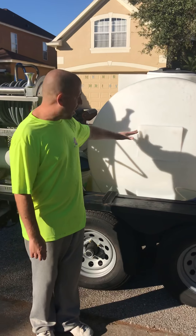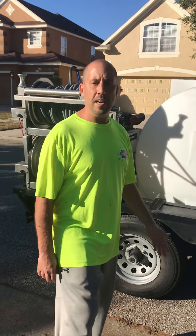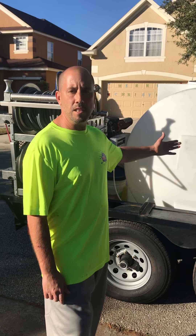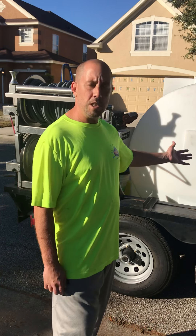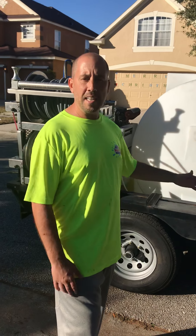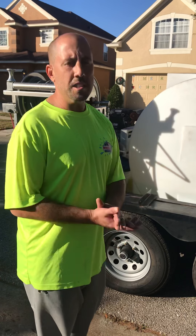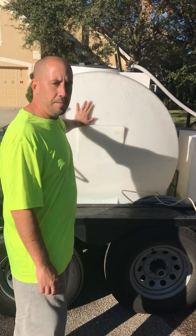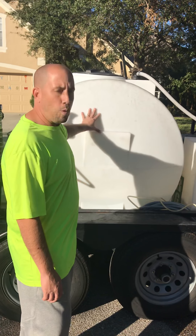Typically we like to keep it about half full. You don't want to be traveling with that much weight holding the trailer down, so a good rule of thumb is to keep it somewhere between 75 and 250 gallons as we're working. It's imperative that if you've got both machines going, one person keeps an eye on the water levels at all times, because if you run out of water you can cause major damage and cause the pumps to shut down. This is a very important piece of the whole trailer setup.